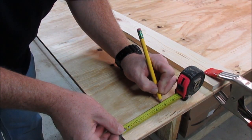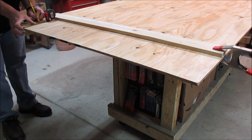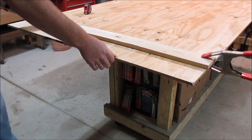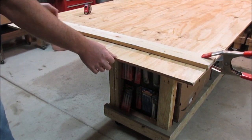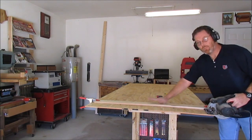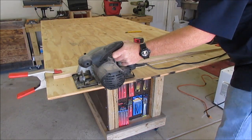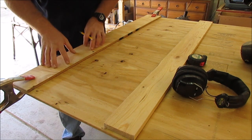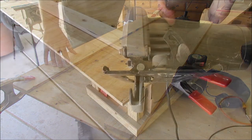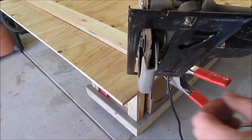I'm going to start by measuring off five inches from the end of the plywood and cutting off some strips five inches long. You can do this with your table saw, but I'm just going to use my circular saw and the board as a guide. You can then take your cutoff piece you just cut and use that as a marker for your next line. Just remember to make sure you leave enough space between the blade and the end for your cut — in my case it's an inch and three eighths.